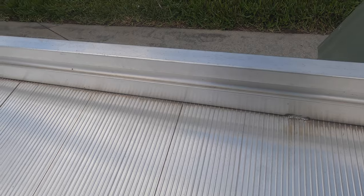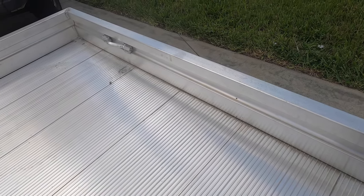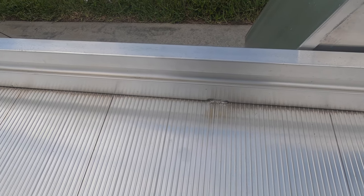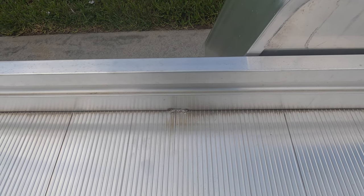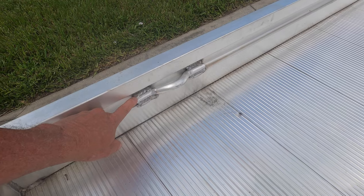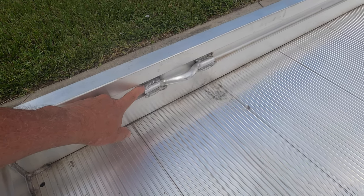If you look along the trailer, you'll see that the next weld for the deck is clear up in the corner — so we're talking a span of about four feet with no welds. It looks like they put the trailer together as efficiently as they possibly could without putting a real good row of tack welds into the deck. There's no question the MIG welds will be functional and hold; it's just that TIG welding makes for a stronger joint.